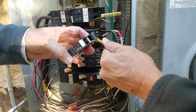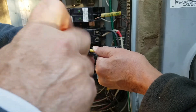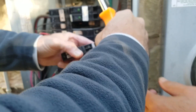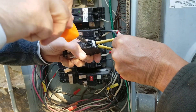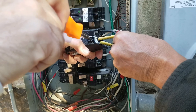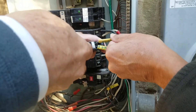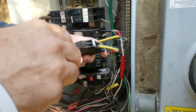We get the new double breaker and push it into the hole and tighten it up. It just so happens that these two are both for my electric furnaces upstairs. We're going to make sure these are tight and that the insulation wire is below the indentation so there's no chance of this thing sparking. They're in there — give them another tighten.